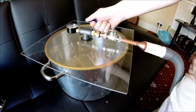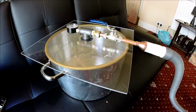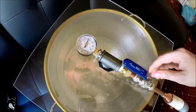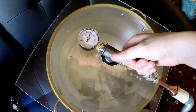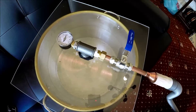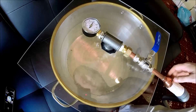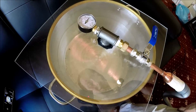It has a really good seal on it — I just need to get a larger pump to be able to degas silicone. As you can see, it holds at just above 0.2 bar. So the seal is really good; I just need to get a stronger pump.